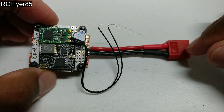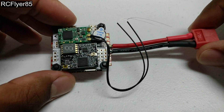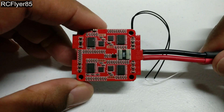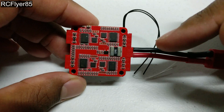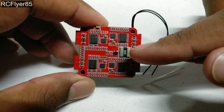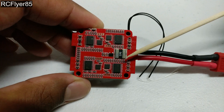As you guys can see, I added on my own XT60 because it was red and I figured it went better with Emax's color scheme. On the bottom here, you have your 4-in-1 Bullet 30-Amp ESCs. These are BLHeli S ESCs capable of DShot — pretty well known in the market right now. You got your shunt resistor right here.